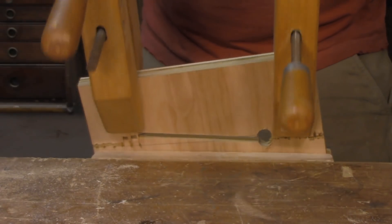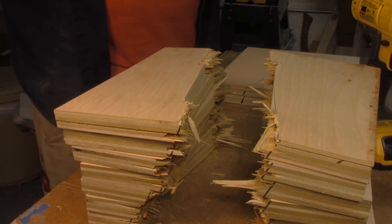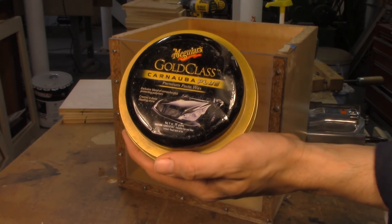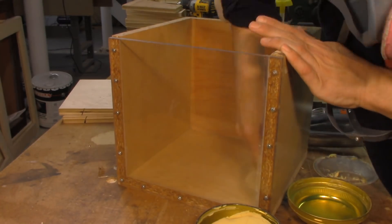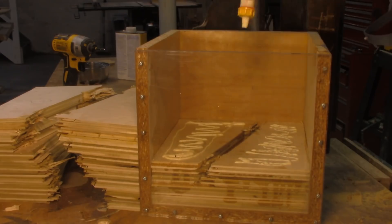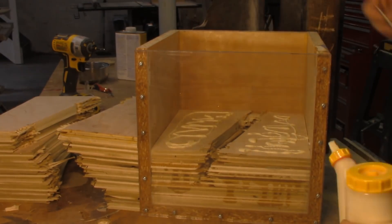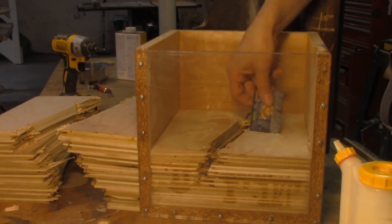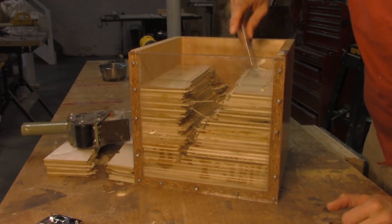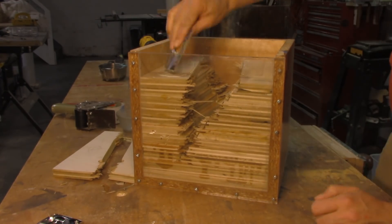This is going to give me the look that makes this bowl really dramatic and interesting. You can see all the pieces stacked up with all the ragged ends. I'm going to be using resin and I don't want it to stick to the container, so I have this carnauba wax and I'm just going to do a coat of that all over the inside. I don't have any mold release spray and I'm too cheap to buy some, but this should work. I'm stacking the different pieces of plywood using a lot of glue — much more than I would usually use — because I don't want the resin leaking in between the different sheets of ply when I pour it in. I put on a lot of wood glue, stack the plywood, and then put these pieces of railroad track on top as clamps. This probably took me two or three days because I would only do two or three layers at once, let them dry overnight, and then add more with a lot of weight on top.